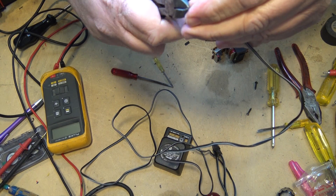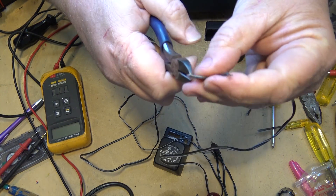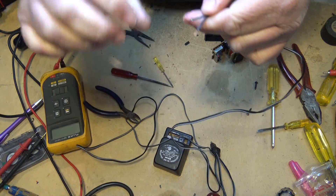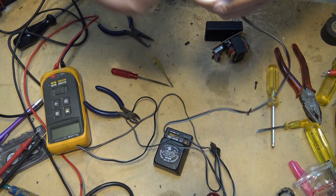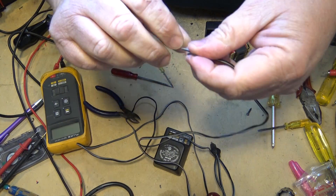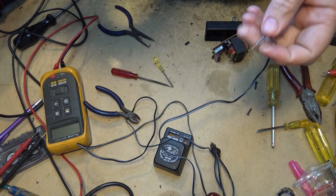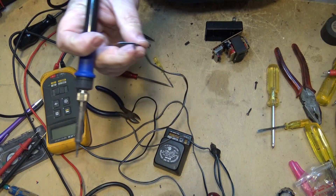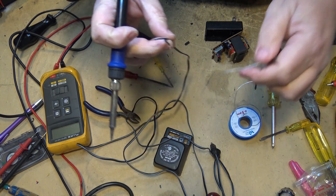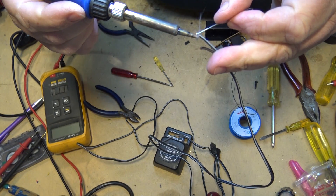Hopefully it's not burned out — hopefully the transformer itself isn't shot after going to all this effort. As I say, I spent about 20 minutes getting into this unit. So hopefully I'll be rewarded with a working multi-voltage unregulated AC adapter. Maybe for the heck of it we'll change that capacitor while I've got it apart. I'll test it too before I put it together to make sure that it's actually putting out power. So just tin the wires here.